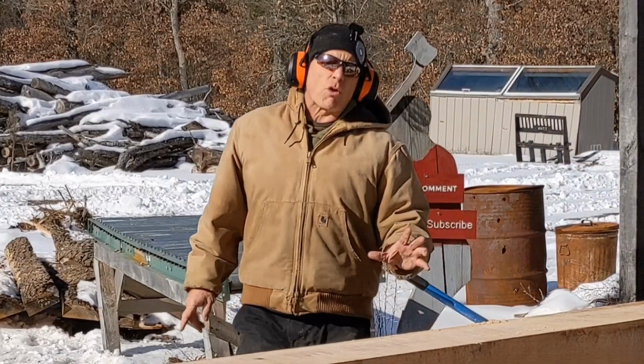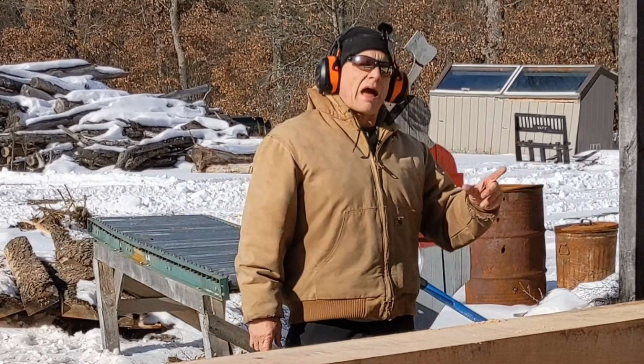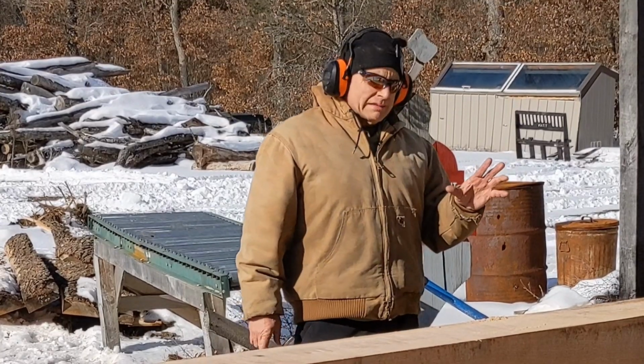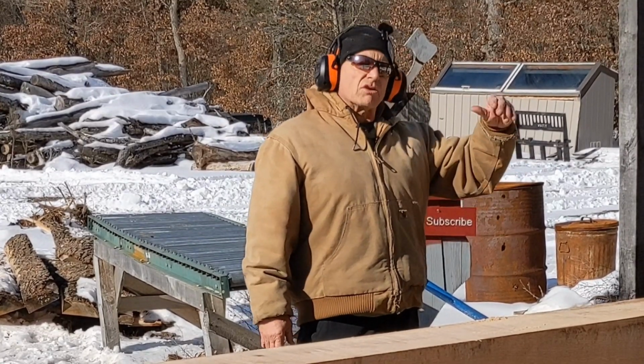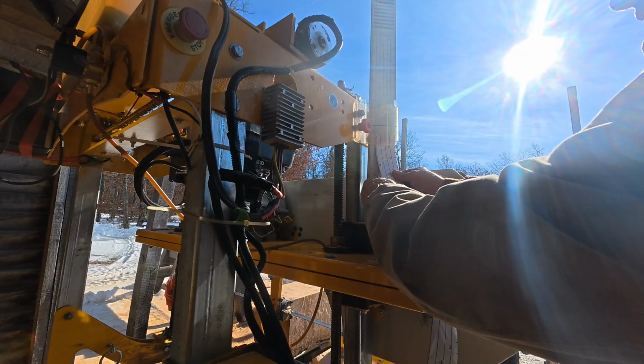So we're gonna make 5/4 inch boards here, and we don't have a 5/4 scale. I made a 5/4 scale. I'll show it to you when I put it on here. You can do it with the regular scale. You just got to add an 1/8 every time. I just completely made a new one.